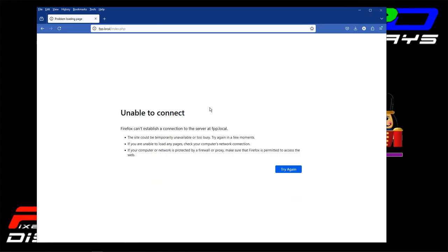Well, it shows that our screen is booting. I really do like the screen. And it probably is going to take a few moments because, like you said, it's building the file structure. Yeah, it's expanding. Is that like a 64 gig card? A 32? This is a 32. Yeah. So I mean, it's basically taking a 4 gig partition and making it into a 32. So it's got to readjust all the internal structures and stuff, and takes a little bit.